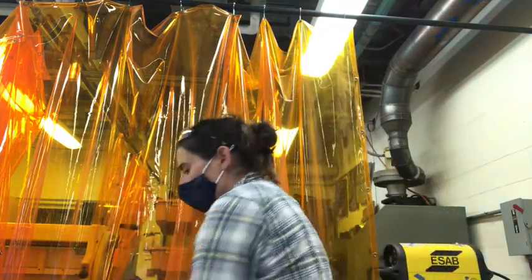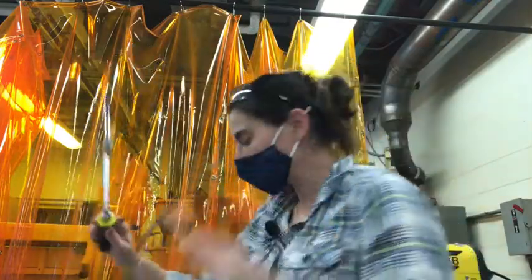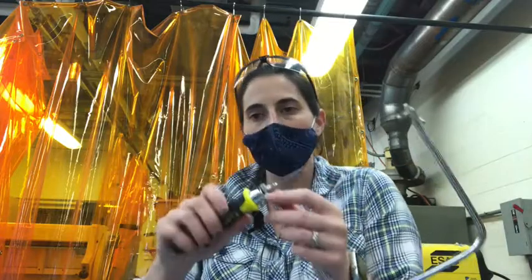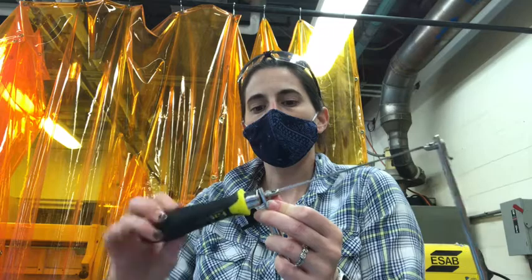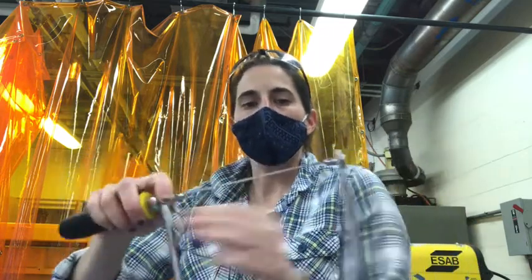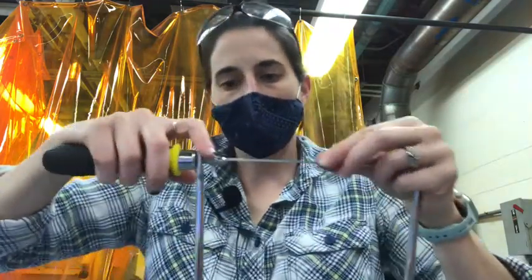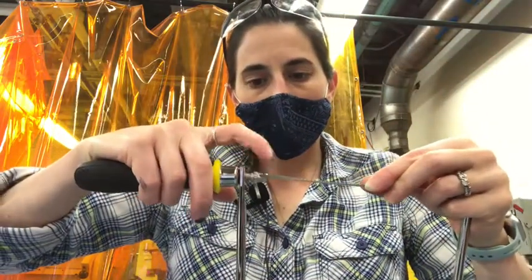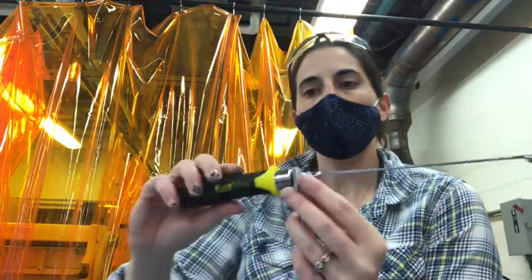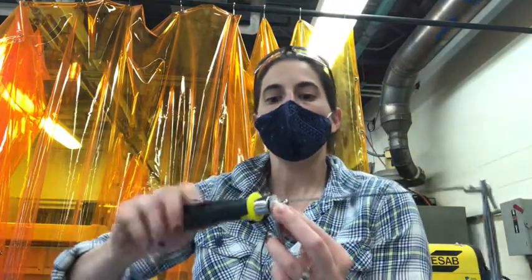So we talked about the coping saw - it's the hand version. There are different varieties, but the same concept. You hold the piece near the handle so it doesn't rotate, twist it counterclockwise to loosen the thread. Notice it's coming out, which reduces the tension, and then I push a little bit and it pops out the T-blade. To place it back in, I do the same thing: push a little bit, find my alignment, hold it in place so it doesn't turn, and rotate clockwise. That closes the coping saw.